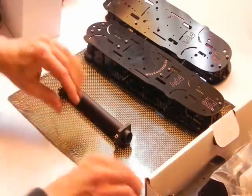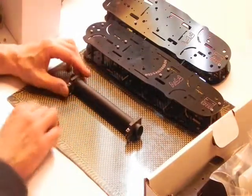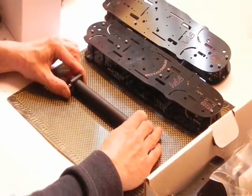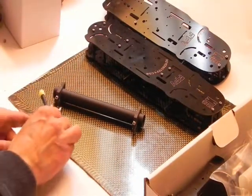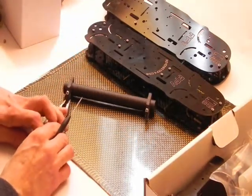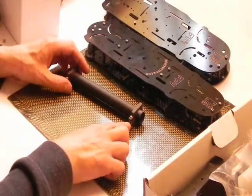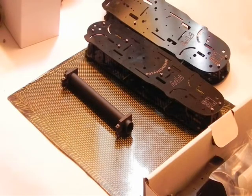After you tighten that down, recheck that your arm is square. Should sit flat. There you go. Now with these on, you can actually, with pressure, straighten them out if you have to, and then retighten as necessary. It should only take a few minutes to set this up because the plastic will set your square base. With the socket it might be a little bit easier, but the Leatherman tool has a lot of uses, so there we go. And we're going to tighten this one down. The plastic can almost touch, about a 1 or 2 millimeter gap there. And there we go, we have our arm all set, ready to go into the quadcopter.